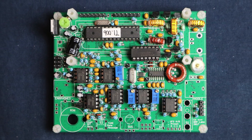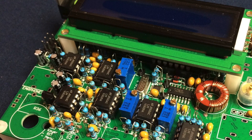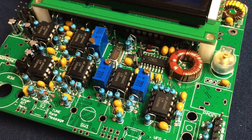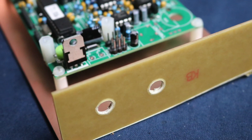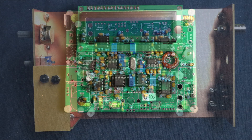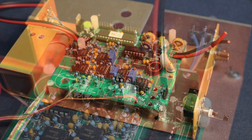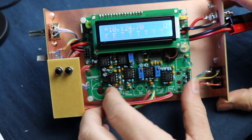That's all of the main components, with just the display, input/output sockets and controls left to do. The pins from the 16-way header socket only just reach flush with the top of the PCB, however with a little heat the solder flows down through the hole effectively. The board is designed to hold everything, however if you mount all of the connectors and controls to the PCB you'll immediately spot how hard it is to fit the radio into a case — the display is at a different height to the controls, which are not aligned either. I knew I'd want to take mine portable, so I've left the encoder, volume potentiometer, headphone and paddle sockets, power sockets and control buttons off the PCB and replaced the 3.5mm stereo sockets and buttons with chassis mounted versions, and fitted a standard 2.1mm DC power socket. To test and align the radio and road test the chassis layout, I've used PCB board to build a framework of an actual chassis to mount everything to.